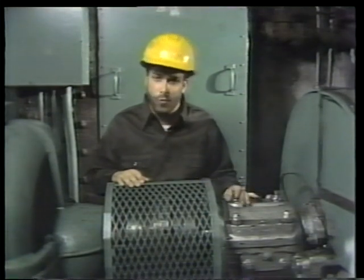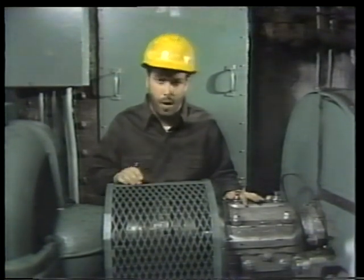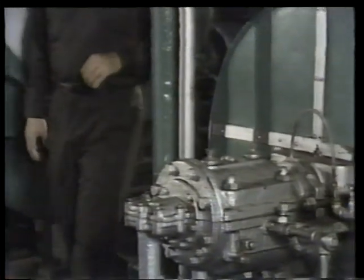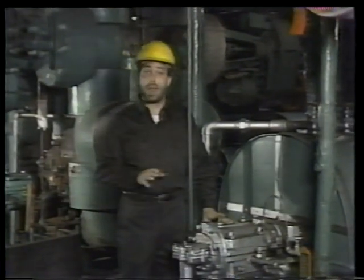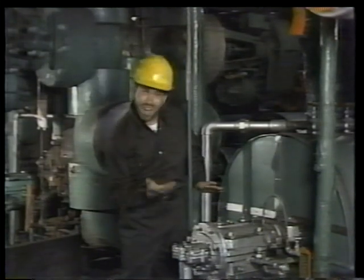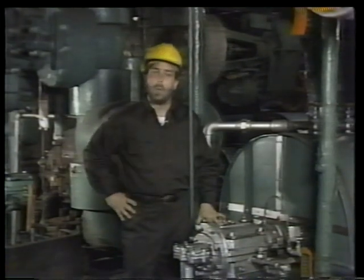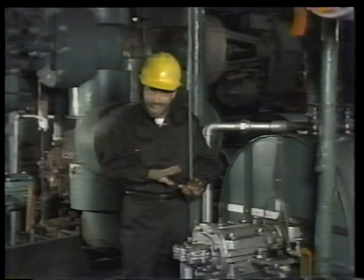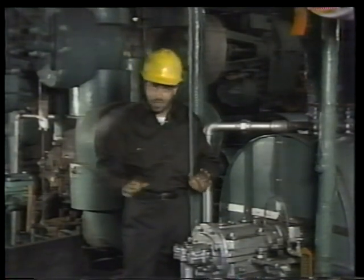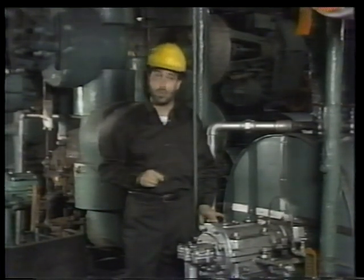This journal bearing is the first one we're going to look at. When it's back together, we're going to move to the other end of the pump and work on the thrust bearing. Actually, this one's a combination journal and thrust bearing — it supports both radial and axial loads. On this particular multistage pump, one side is at a higher pressure than the other, and that pressure creates an outboard thrust on the shaft, tending to push it in one direction. The thrust bearing keeps that tendency under control.